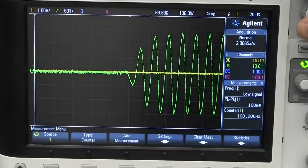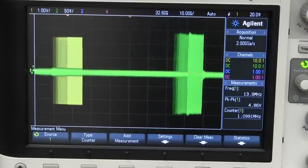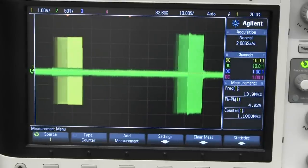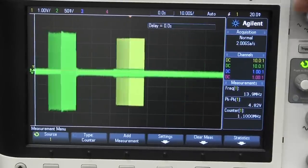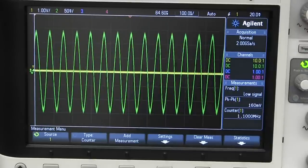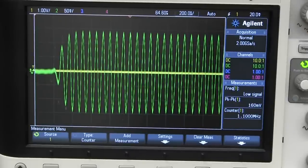Let's have a look at our output here — you notice that it is positive-going, exactly the same as the input which is also positive-going. Now let's see what happens if we reverse the polarity on our output terminals. And bingo — it does go negative. I just swapped the polarity on our output, and as you'd expect, it goes negative while the input still goes positive. And if you're wondering if we can do anything by physically touching the glass — not much at all. Let me tap it. We can't really see much happening there at all.